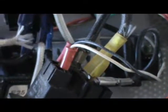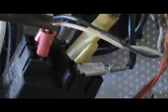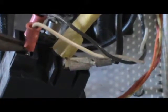Now, just like the instructions say, it's really important to only take out one thing at a time and put it into the new relay over here. We want to make sure it's oriented right - you can see we've got two red plugs on the left, and here we've got two plug ports on the left, one on top and one on the bottom. It does look like that is exactly what we're looking at. So we're going to pull these wires out one at a time and put them in the new relay. It's important to remember that you need to pull down here by the connector where it goes into the relay - never, never ever pull up here by the wire. Only pull down here by the connector.